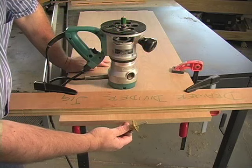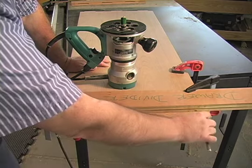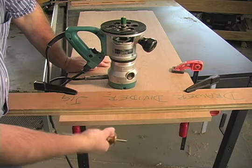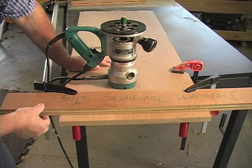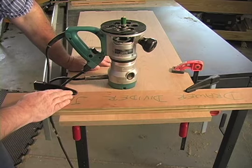The first step to make the breadboard tenon is to lay off the length of the tenon itself. I set a marking gauge up and roll down both faces of the board, creating the line on both sides. Then I've taken a plywood jig that's just used as a straight edge — it's two thicknesses of plywood. That has to be set in conjunction with your router bit, and I've laid that right to the line, adding clamps to both sides.